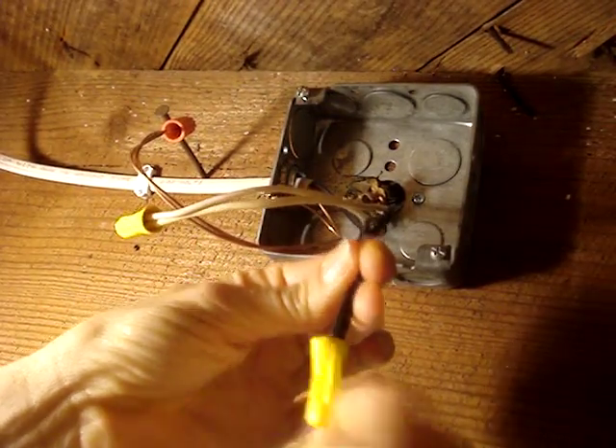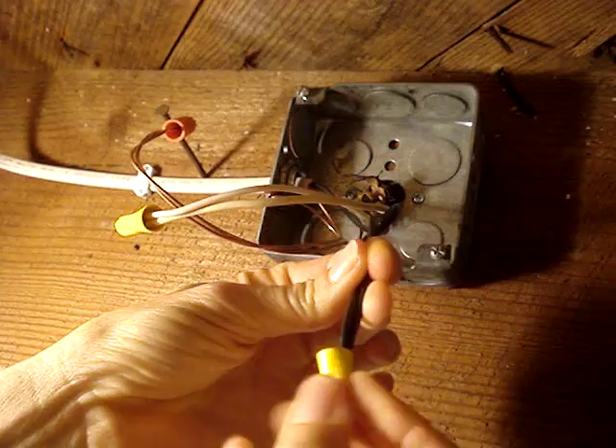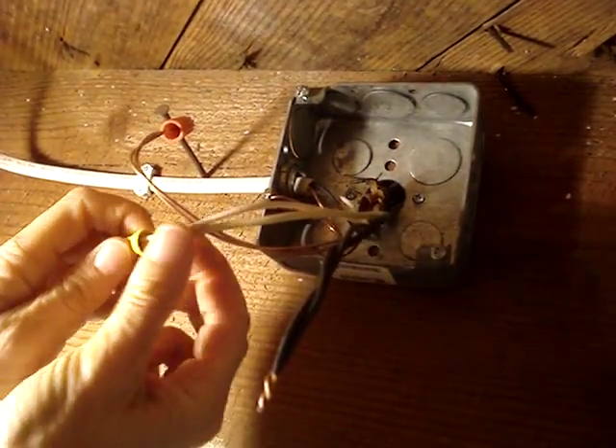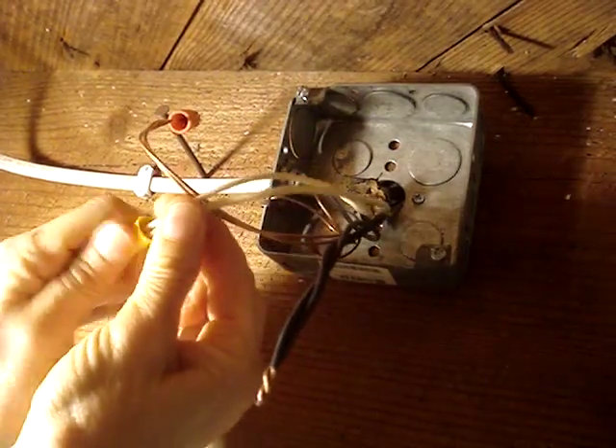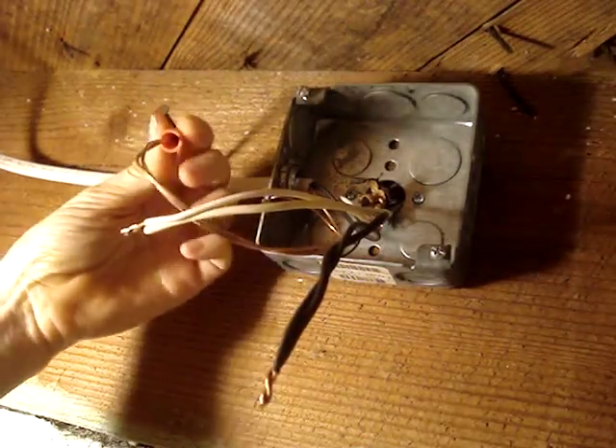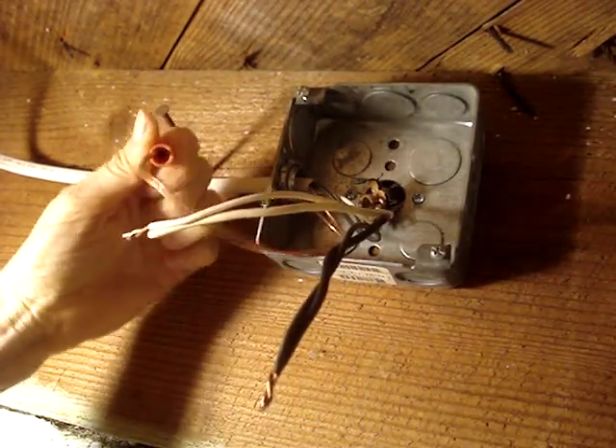It's difficult to replace existing cable that's not in conduit. Because this is a short run and there isn't any insulation in the wall below the bottom of the outlet box, odds are good that I can remove the old cable and fish a new one in its place.